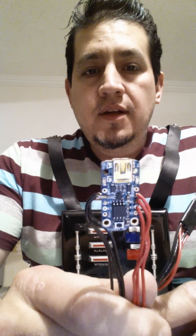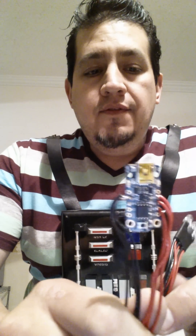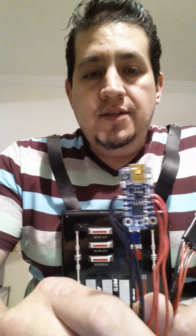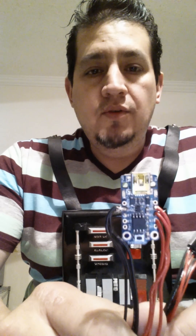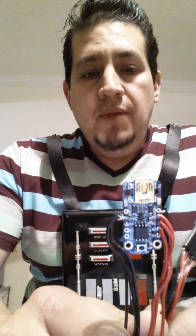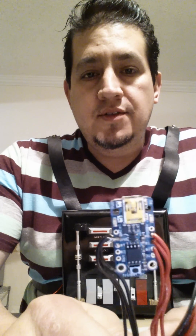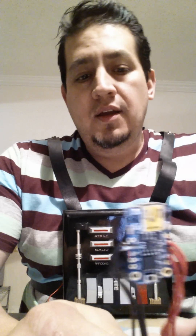The reason I was interested in this one is because it has five IOs, or inputs and outputs, and you can do lots of stuff with it. It does not have full-blown Arduino features, but it has most of them. It's based on the ATtiny85 processor, which is this little chip right there. As you can see it's really really small. This is a micro USB connector, so you can use that for uploading the program.